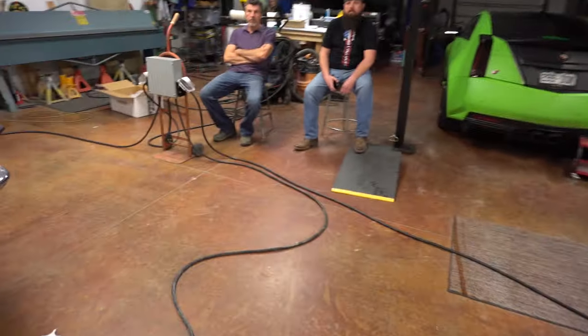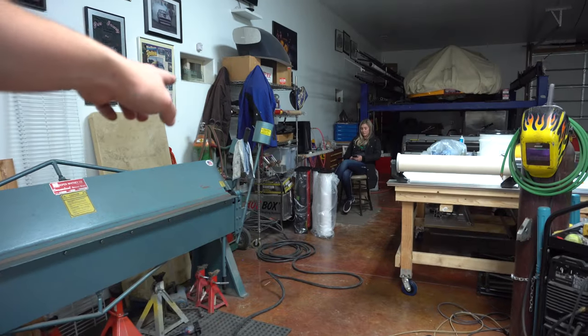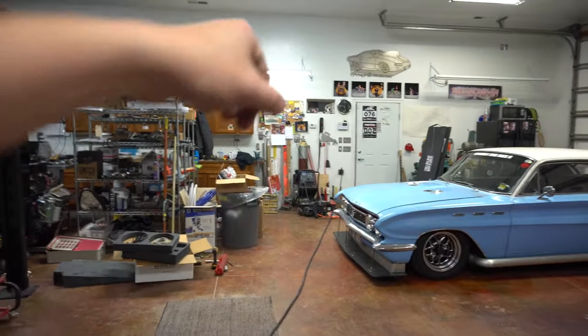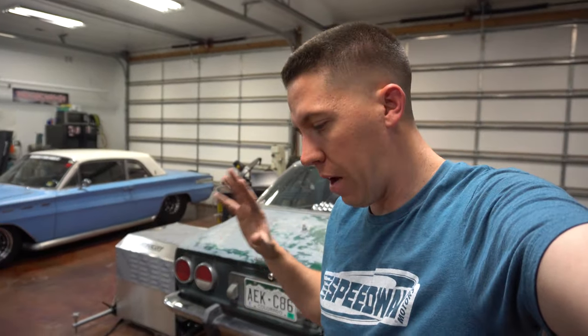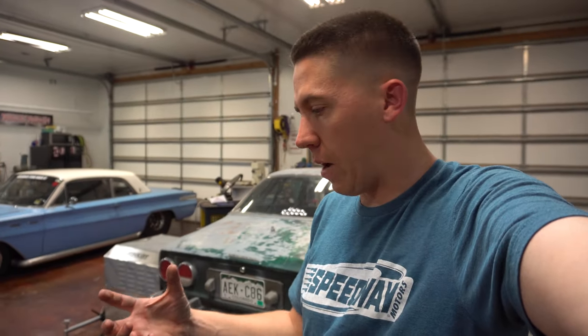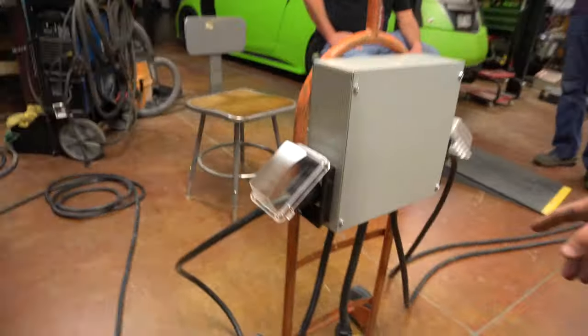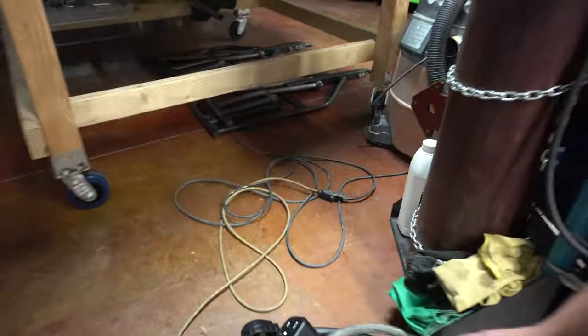Here is the electrical box that we came up with. We have two extension cords that will run over to the 30-amp breakers here in the shop — that's fairly common in some shops. Also, the requirements for the machine is something in a 50-amp capacity — I call it like 60, but 230V will be 60. Each pod can pull a maximum of 25 amps, so a 50-amp breaker would work too. If I go into a shop that has one single 50-amp, I have this plug here — we built an extension cord as well for it, so you can plug into that and it would go over to a building that has a 50-amp plug. Pretty much makes this unit plug-and-play as long as you either have two 30-amp plugs or one 50-amp plug.